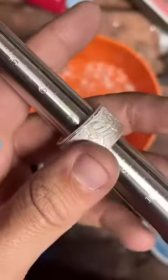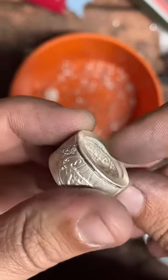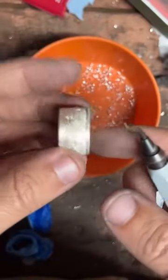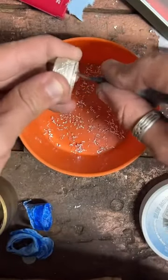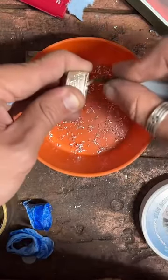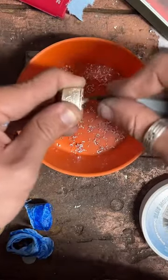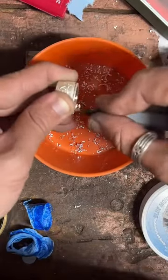And it's under our size, which is good, because we still have a little bit of this lip to take off. So that'll make it a little smaller. It's just easier to do when it's nice and straight-walled than when it's kind of a cone shape. But if I don't remove some of it, it starts bunching up. So I have to kind of do that in two steps. It's way easier to get rid of when it's like this, at like a 90-degree angle.